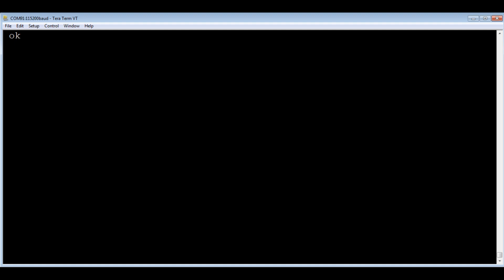I have TeraTerm running on my computer talking to my SCAMP board, which is connected to the DS3502 digital pot. There are only two Forth words needed to control the wiper movement. We can write a value from 0 to 127 — the position on the resistor stack. Typing 64 and writing to the pot puts the wiper in the middle. Writing 0 puts it at the bottom, and writing 127 puts it at the very top. We can also read the pot to confirm the current position — it returns 127.